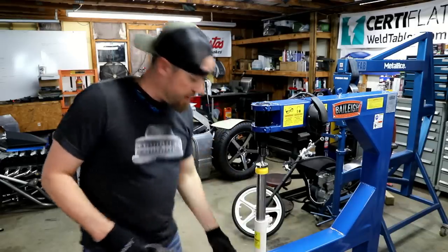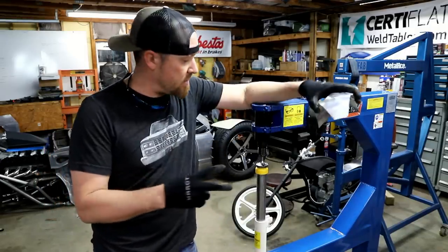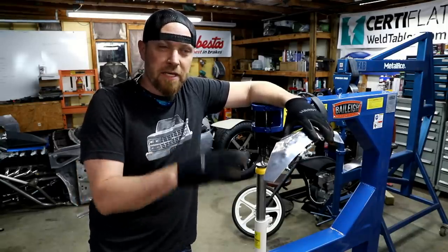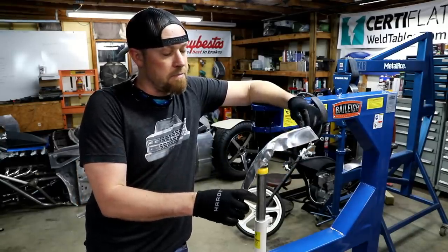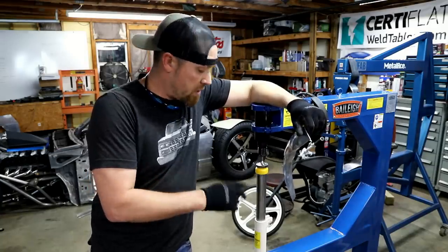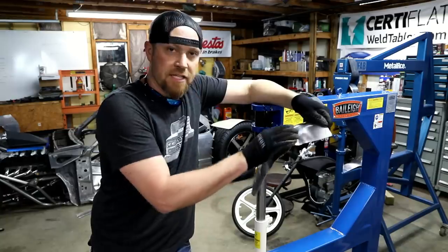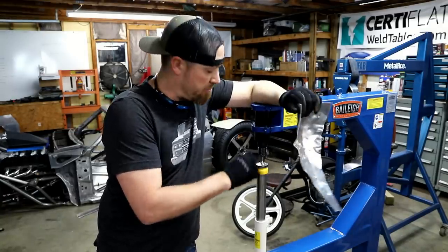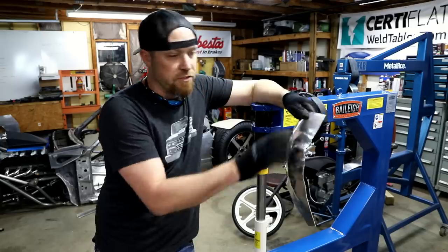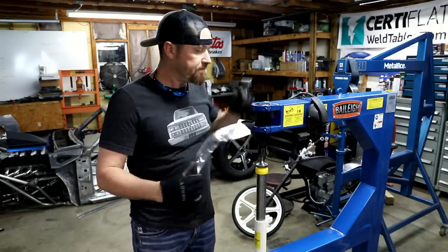All right, so the planisher's ready. And there's kind of two ways that you can adjust how fast you work a piece and how hard it works that piece. One is with the tension. So this thing moving up and down, kind of the tension you're gonna put, or the gap that you're gonna put in here, it's gonna kind of fit around this panel. Now I'm gonna have it kind of loose at first just to try to get all these wrinkles through there. You don't wanna try to be able to feed those through there.